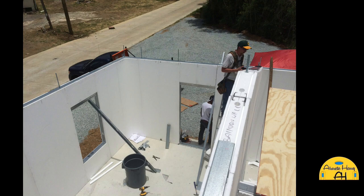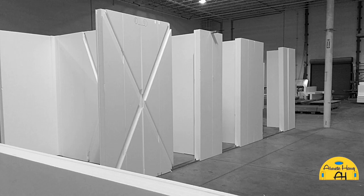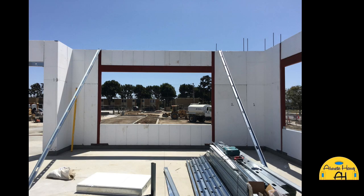Giga House, if you're not familiar, their homes are built using custom made steel studs that they produce in house. Then they have CNC wire cutters, and they cut the foam into the shape of the studs. After they place their steel studs, they slide over these foam blocks, and then they cover it with a mesh and then a magnesium based cement. They have a stucco and a plaster mix, but they're very expensive. Because I'm using it very thinly, it works for me. So that's the route I'll be going, and I'll be sharing that further along in my build process.